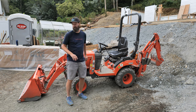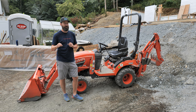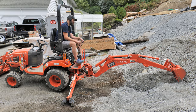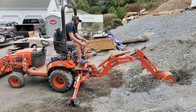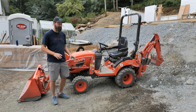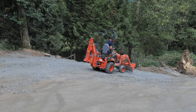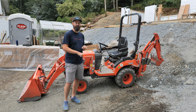The multi-functionality of the hydraulics on this machine is pretty awesome. That's one thing with the John Deere 1025R — the one series — you can't really multi-function in terms of lifting the bucket and dumping it at the same time. On this machine you just come into the corner on the stick. When it comes to the backhoe, it's pretty Mickey Mouse — if I was going to get this tractor, I'd get one without the backhoe. They make one that's slightly bigger, the BX2680, which has three and a half more horsepower. That extra horsepower would come in handy on a steep driveway — when I was back-dragging up the driveway it was slow and lugged out a couple times even with the RPMs cranked up.